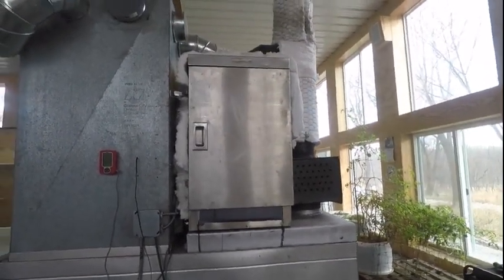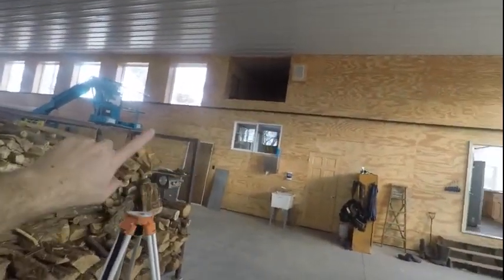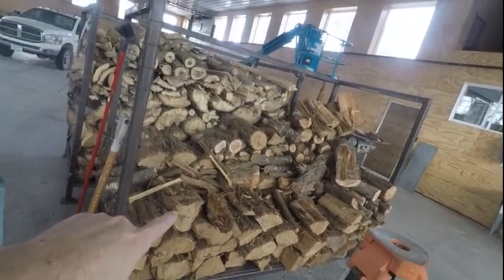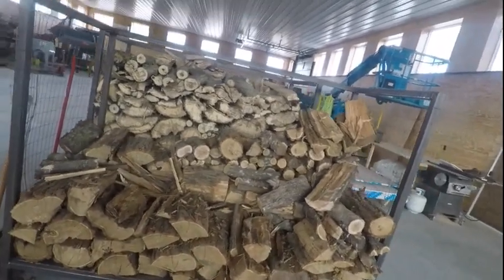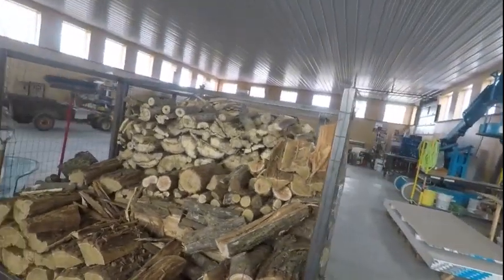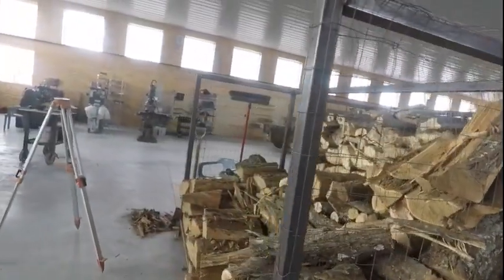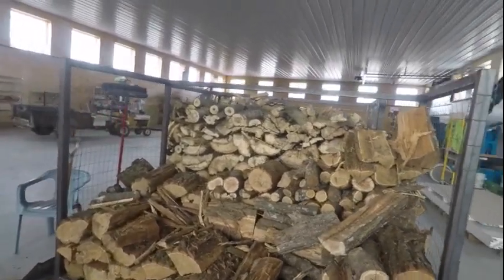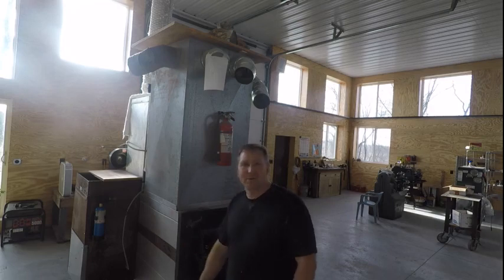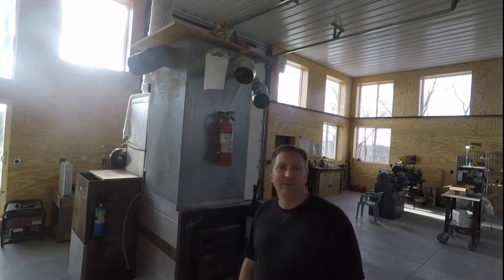Definitely make a smoker attachment a side-by-side setup - it's been working real good, I've used it about a year now. I have the discharge on the furnace blow in one direction so it circulates around the entire shop in a circle, keeps the heat even, and blows on my wood to make sure it's all dry. These are my firewood racks - I can carry them with the backhoe, they hold about a cord and a half, four by eight by six feet high. I'm going through about six of them this year to heat everything - maybe eight or nine cord total for both the shop and the house. If you've got one of these furnaces, don't throw it away - use it. That's all I've got for today, thanks for watching.